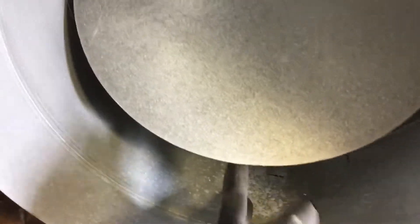As you can see, there's a hard 90 here - and it was actually even harder when I'm moving it. This door flap is supposed to be closed. You can see this opening right here; even though it looks like it's not too open, it's actually in the closed position but it's still open. It says closed, it's supposed to be closed, but even when setting it and bypassing it all the way to the closed position, it doesn't close.